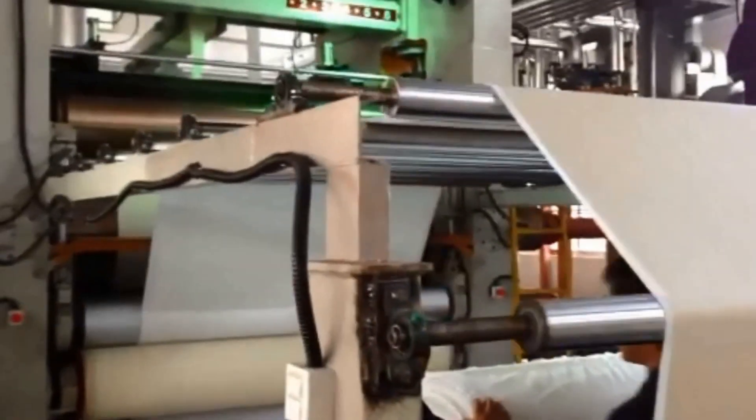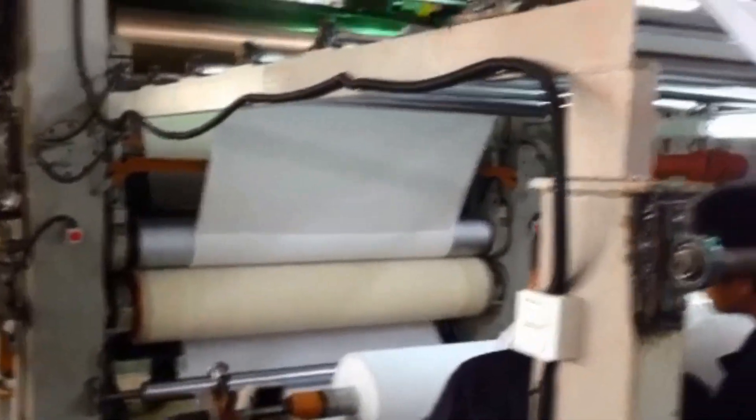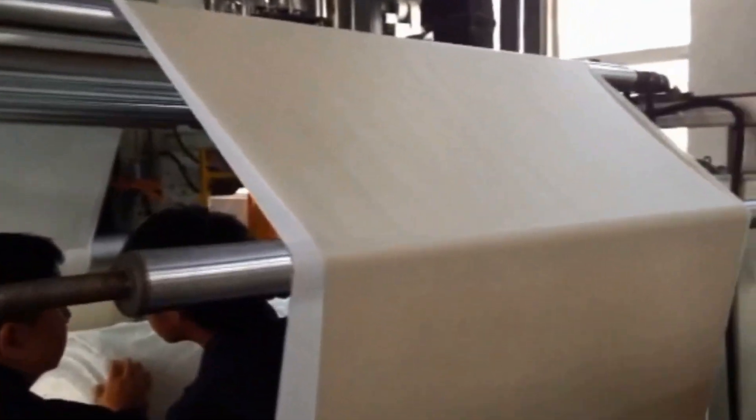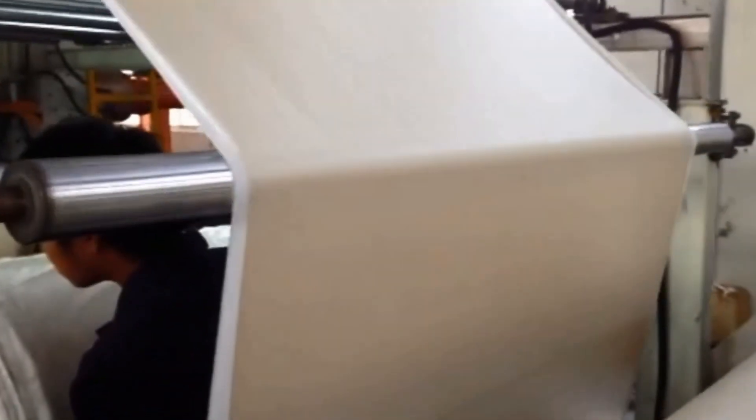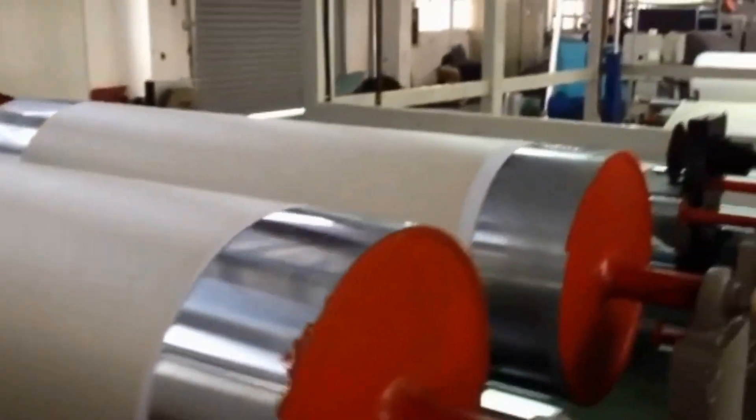So the third stage is basically, as it got fused over there together, those were the two parts where they met. Here comes the clean sheet of PVC vinyl, and it gets cooled down through these cooling rollers. It gets wound up through the back side here.